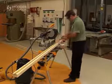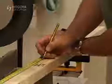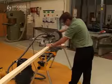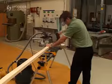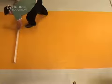Calculate the total quantity of timber required before beginning to mark and cut each piece to length, whilst referring to the original drawing and site dimensions. Lay all the components on a clean and level surface in the order they are to be assembled.